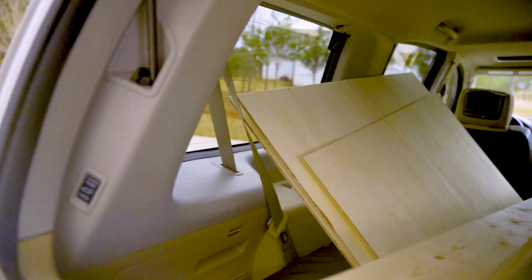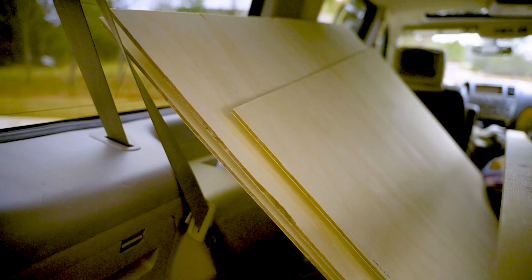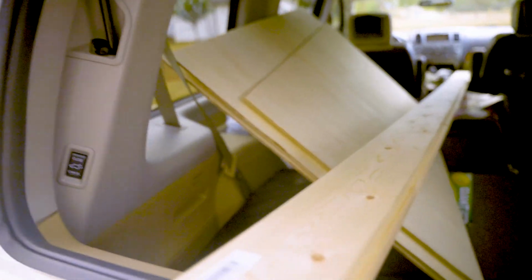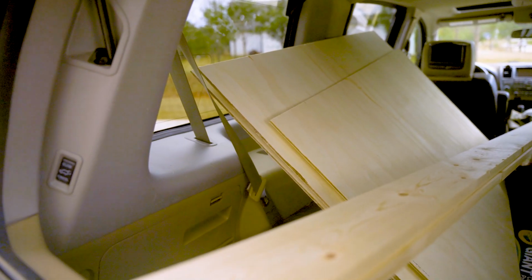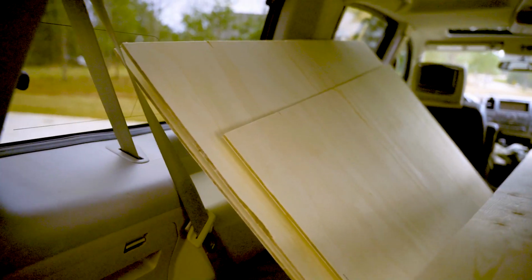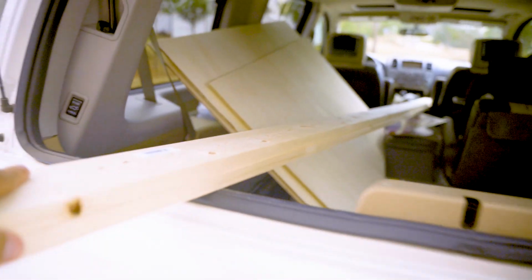And as you can see, I had them cut. This back here is 1/8 inch plywood, and I had it cut down to two 34-inch panels, and that left me with maybe about a 30-inch panel. So I got 3 panels out of it, but I'm only gonna use those 2 big ones more than likely. So that's what I'm gonna be making today. And that's the backer board. I'm gonna create a frame out of this and staple it to that. Then we put the foam inside, like a little wooden coffin kind of thing. Pretty much I just take the fabric and wrap it over it. So I'm gonna go ahead and get started.